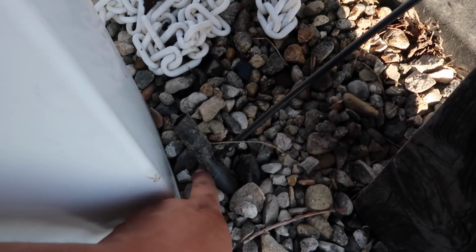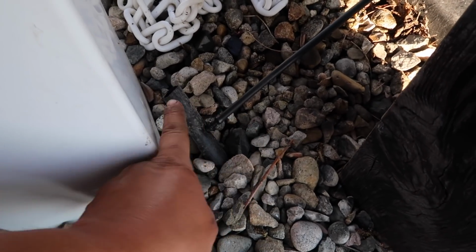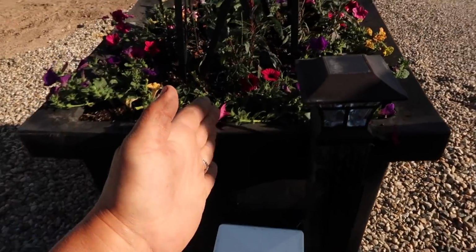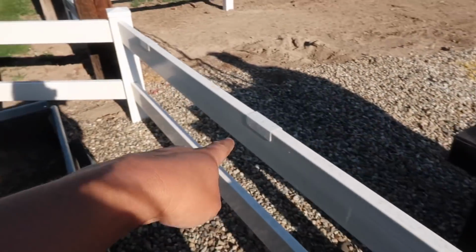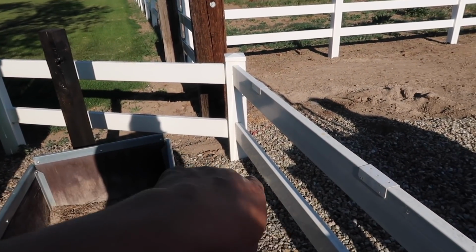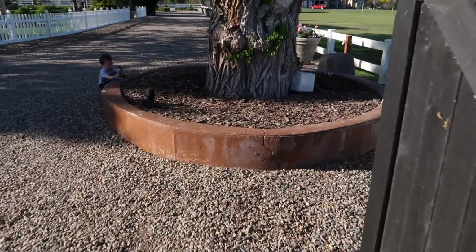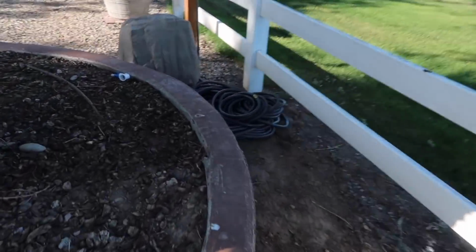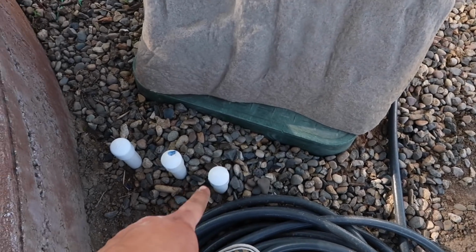Sure. And then I did pretty much the same thing, so we just need to straight couple into this piece. So guys, if you take a look... Aaron, would you mind shading it? You can see it coming out of the second pot here. The black tubing comes down and just connects to the half inch black poly, which stops right here. So we'll put a straight coupler in here, because basically that half inch piece of poly goes from here to where I ended it, right behind that pipe there. So I'll put a straight coupler in and run black poly, we'll kind of scoot the gravel out of the way and do a small trench to run the black poly all the way over to this new box right over here, which is semi-hidden by this fake rock. We've got an extra zone in there that we can tap into. In fact, I think it's one of these.